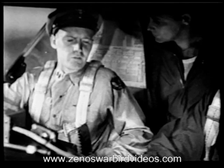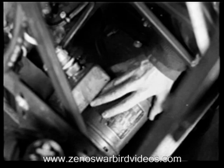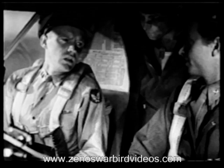You'll notice that Mullins is keeping an eye on the inverters, moving the instrument flying curtain away from the inverter so it can get some air. And he's checking to see that there are no metal objects down there that might contact the inverter points and cause a short.